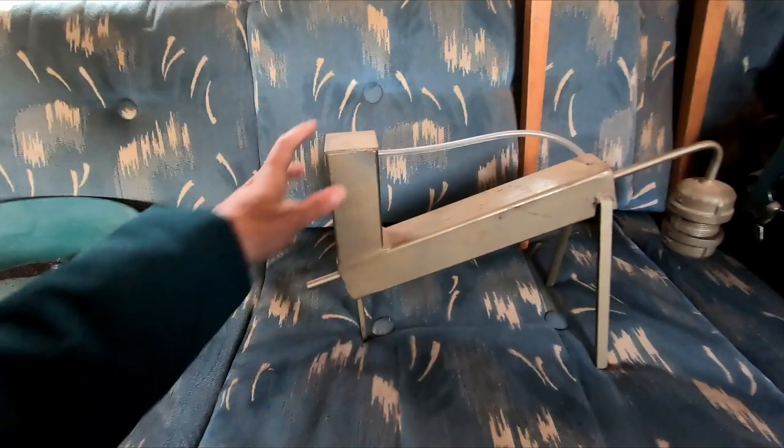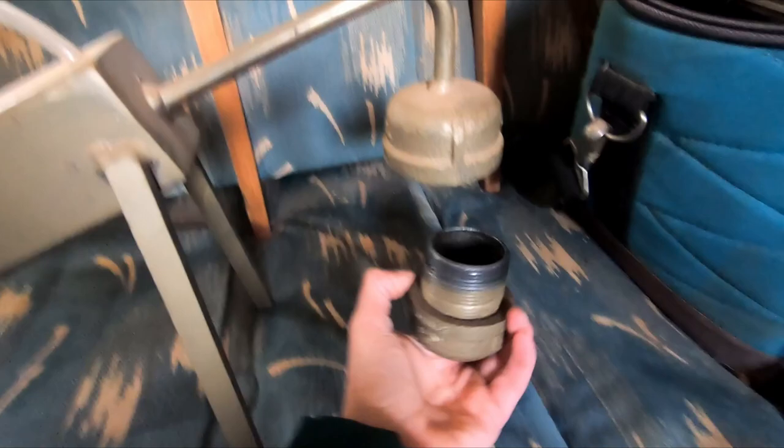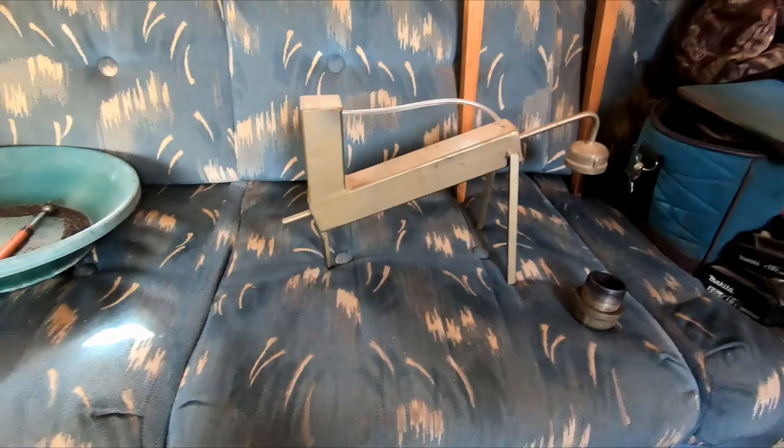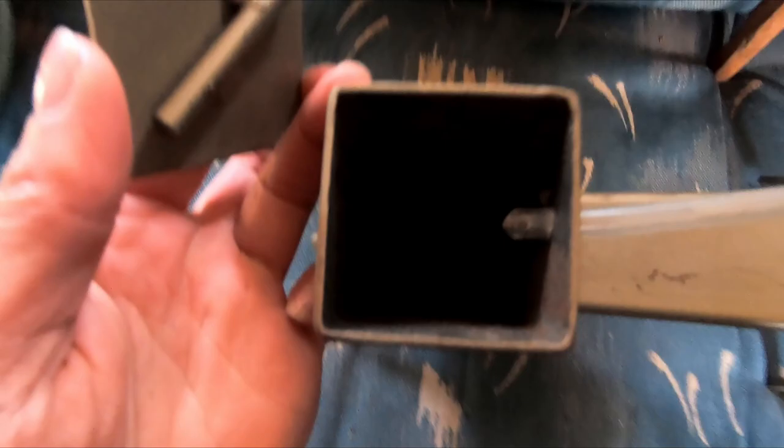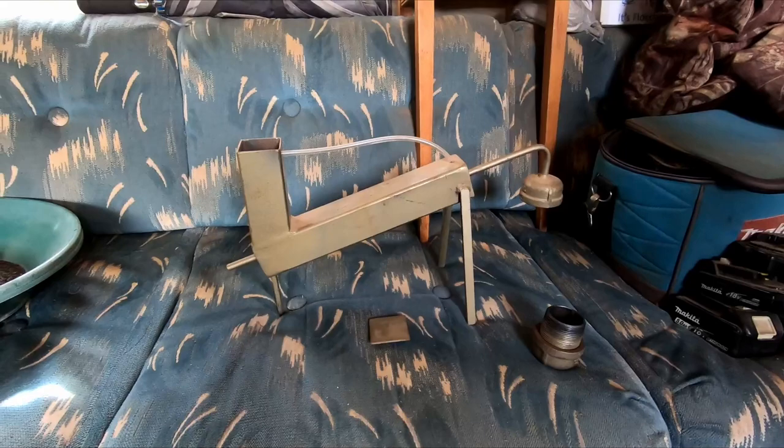This right here is our mercury retort. It's actually a pretty simple machine — or mechanism, I guess. This is our vaporizer chamber cap where you put the mercury amalgam in. We will heat this up to vaporize the mercury. It's a good idea to clean this out with alcohol first and let it dry before you use it. Next, we have our fill chamber where I'll put a 50-50 split of antifreeze and water in. The antifreeze is so the water doesn't boil over. And next, we have the discharge tube — this is where the mercury will turn from a vapor to a liquid and pour out into a cup.